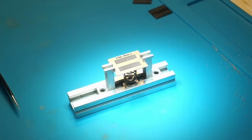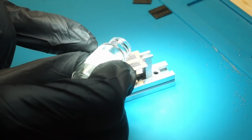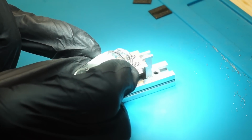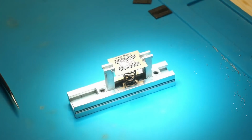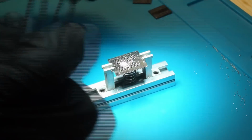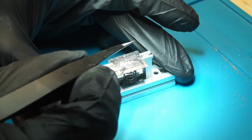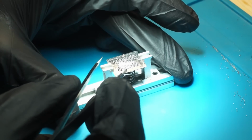This is the 8 GB donor card, and we have to first remove these memory chips. Now that the donor memory chips are removed, we need to clean and reball them. Basically, there are receiving pads on the GPU and there are pads on the chip itself. We need to connect those pads accordingly. To do that, there are solder balls making the contact between the two pads. These solder balls are 0.45 mm in diameter, and there are a lot of them.